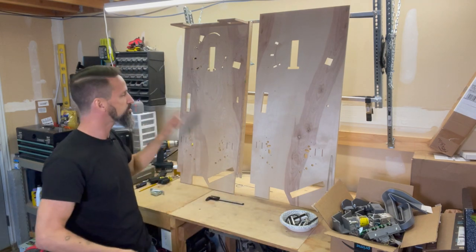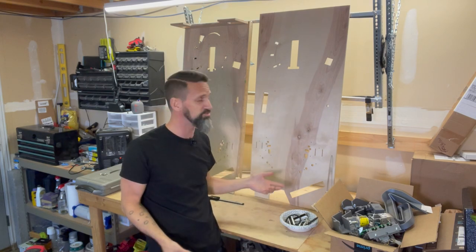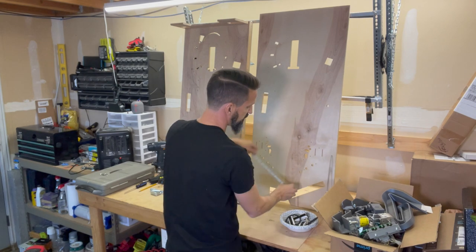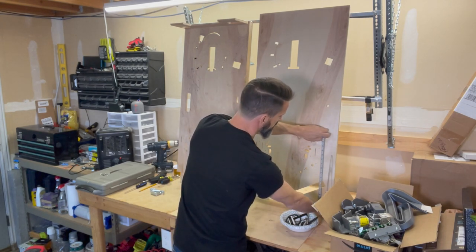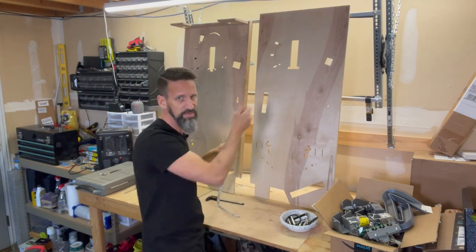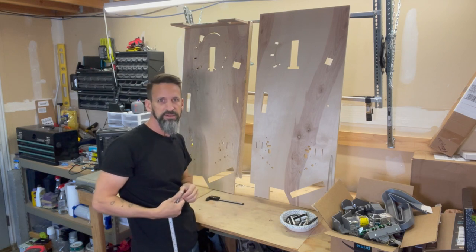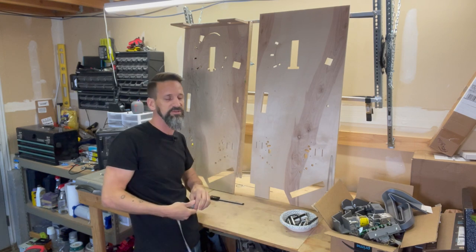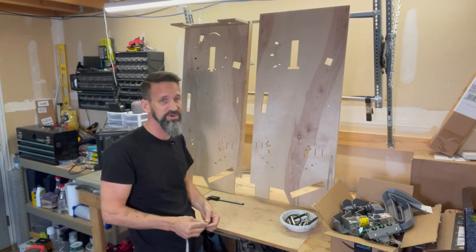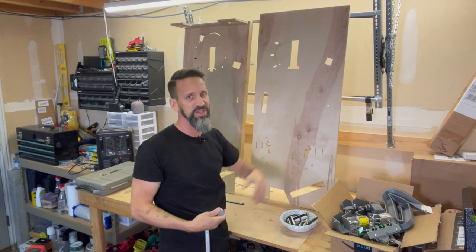So you have the dimensions of the shape. Now how do you know where to put it? For a circle, you want to know where your center point is - pick two sides, probably the two closest sides. For this hole, I needed to know how far from the edge it was: the center point here is 65 millimeters. Then from another edge - I picked the front or bottom edge of my playfield - this one is 605 millimeters up from the bottom. Take your time measuring - double, triple, quadruple check. Because we're doing a homebrew, there's going to be some variance between cutting this playfield and the next white wood, or exactly how you've lined up on the CNC machine. Things might be off by a millimeter. We're not super precise like the actual manufacturers, so take your time and get that as accurately as you can.